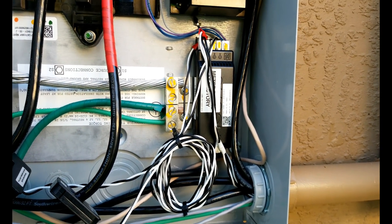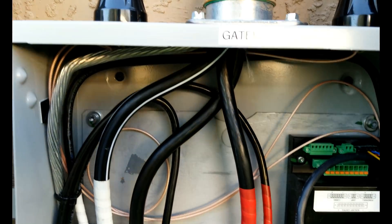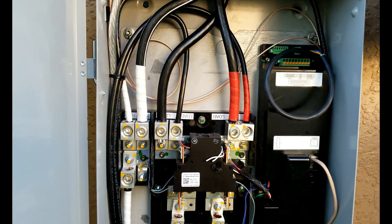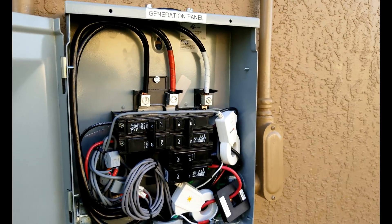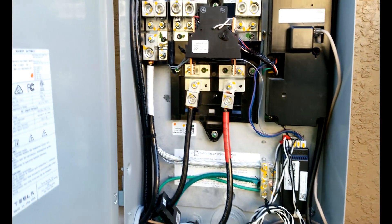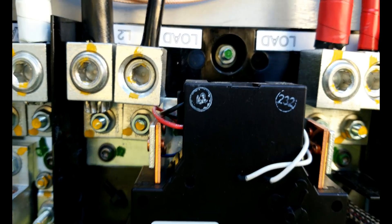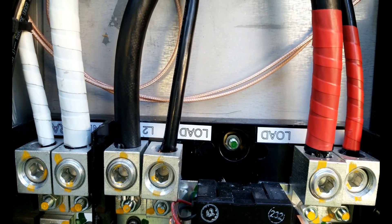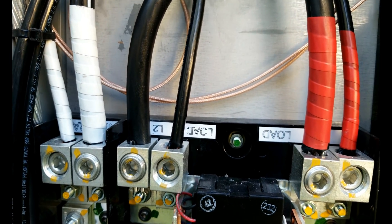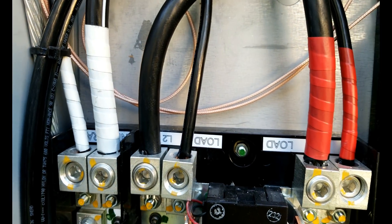Follow me on this. We bring the power in, across, and down. Now we're in the gateway — we have left the load center. We come down through the main solar disconnect, cross conduit, into the gateway. Now we're feeding into the gateway. The smaller of the two gauge wires on L1 and L2 are from the backup system — which is the batteries and the solar generation system. That's the incoming power from the generation panel, that box.